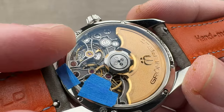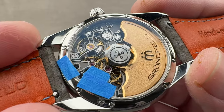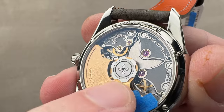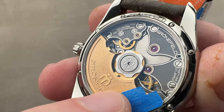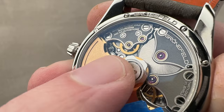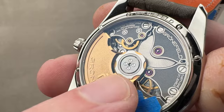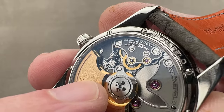Braced against shock, it has a full dual-anchored balance bridge, which is skeletonized, by the way. And it is a free-sprung balance, again for toughness. You can see how the shape of the bridge is like the roofs of traditional bell gable houses in the Netherlands, designed to make snow slide right off. We have golden chatons, pocket watch style, fixing the pivot jewels — that's a nod to the way jewels would be set in golden chatons and then the chaton pressed into bridges back in the olden days of pocket watch manufacture.